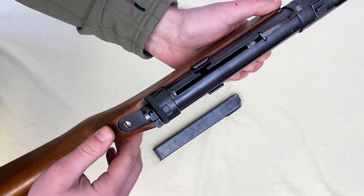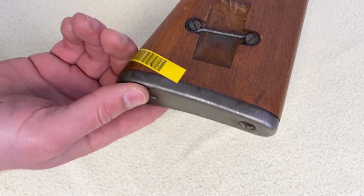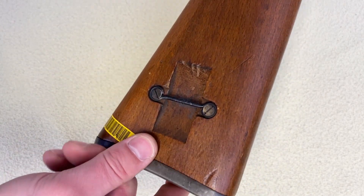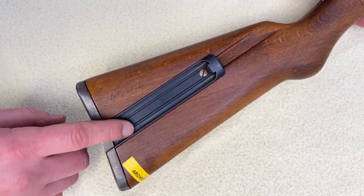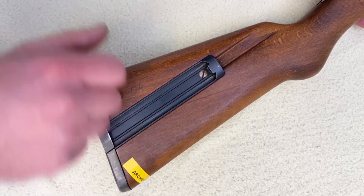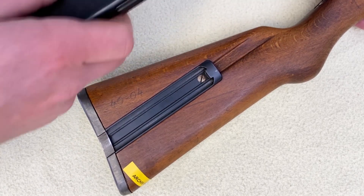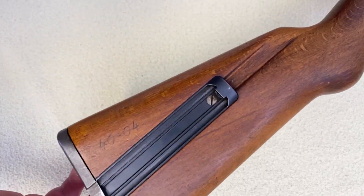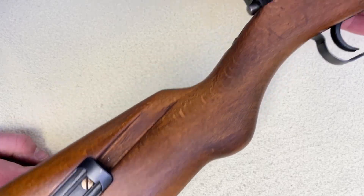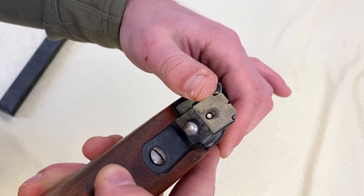This button and the end of the recoil spring hold everything in place. At the rear, the wooden stock has a metal butt plate attached with two screws. There's a cutout with a wire that works as a sling swivel. On the other side is a very clever device — a magazine loader using a stripper clip. You insert a stripper clip with 9mm rounds, press the magazine against it, and it loads the mag while pushing the clip away. Every gun had this in the stock — a very clever design also seen on the SA 23/24/25/26 series.